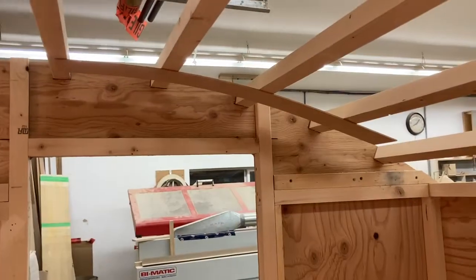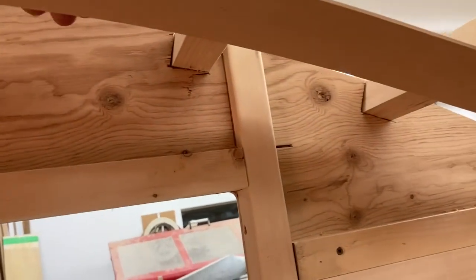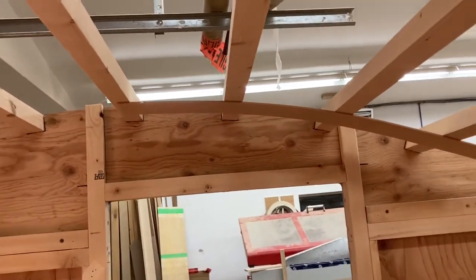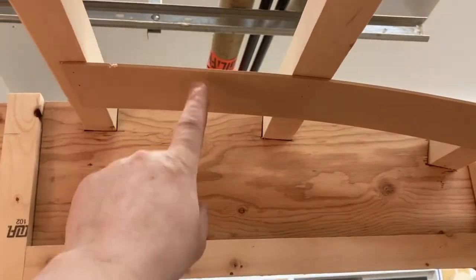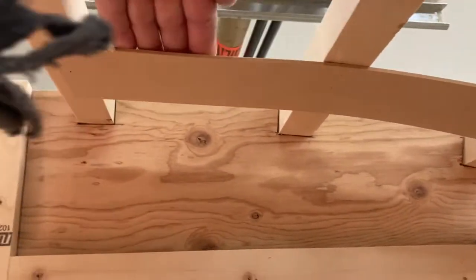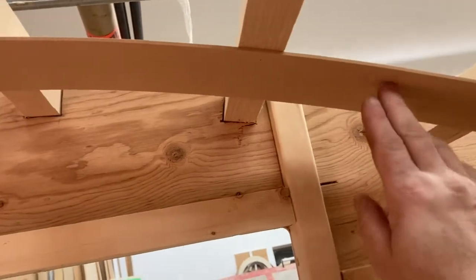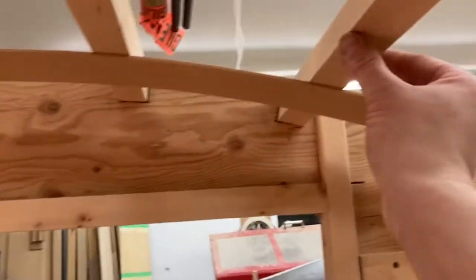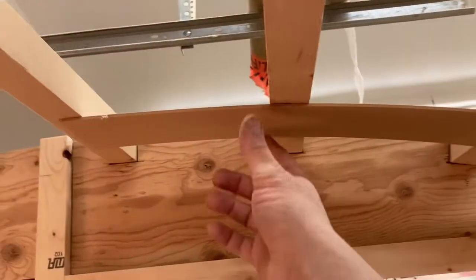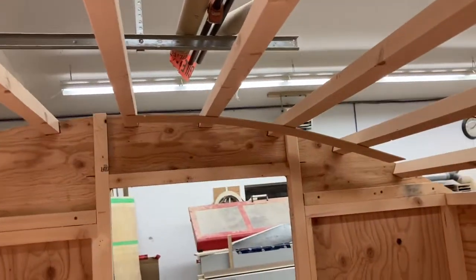It's getting kind of late. I spent quite a bit of time today trying to work out a few details. I plan on having my insulation go right in between, all the way to the wall, and then have my interior paneling. I am concerned — this is MDF, so it will actually be plywood, but it still has some flex. I don't want the insulation, if it's too flat, to give it a segmented look if they're all squared off or pushed up. So what I might do — if I need more space — is put some strapping here to make it a little bit thicker. I was going to do a single layer on the interior, but I might actually do some furring strips every 10 inches or every foot, and then do a solid sheet. It might just help fair the curve.